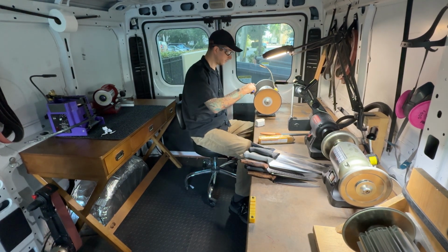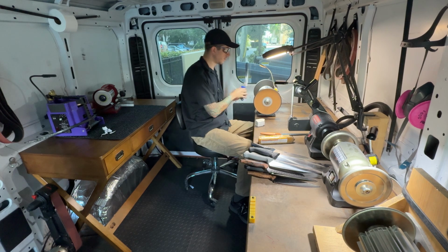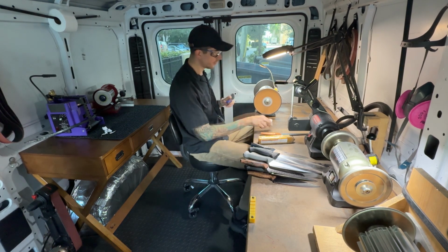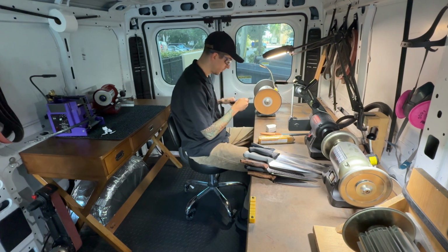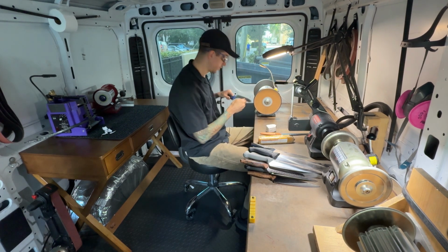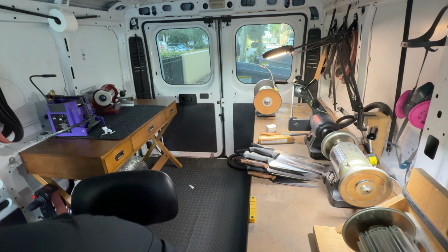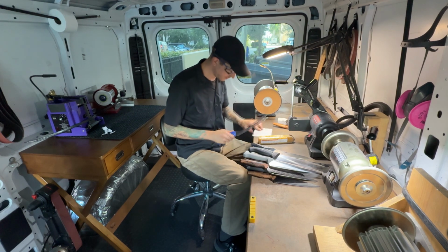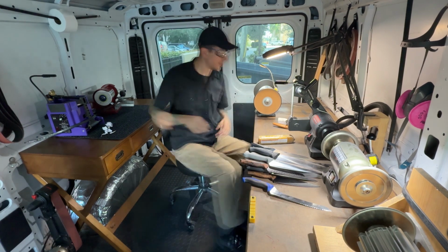So on that bread knife, I did a pass on the nylon wheel on the flat side to move the burr over to the other side. Now I'm doing alternating passes. You can see this method for the serrated knives in a lot of detail in another video on my channel. Now we moved over to the leather wheel, using the corner to get inside of all those scallops in between all the teeth. Back and forth a few times. And this one I am going to test on a piece of paper just to make sure it's moving through it like I'd like it to and looks good.